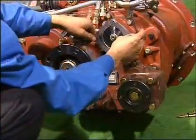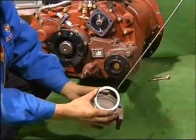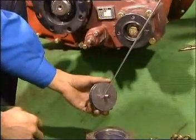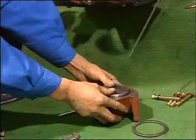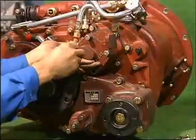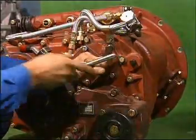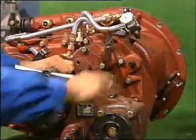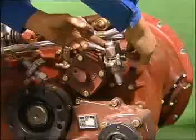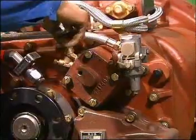Set the gasket of the shifting cylinder cover without glue. Check the cylinder middle assembly, position restricting ring, middle piston, and O-ring. Assemble the middle position cylinder: first install the O-ring in the piston, add lubricating grease and push it into the cylinder body. Second, set the position restricting ring and combine it with the shifting cylinder. Finally, fix the middle position cylinder with 4 bolts with the pressure adjusting installation part outwards. Set the 45-degree elbow on the cylinder of shifting position. Fix the pressure adjusting valve with 2 5x60 bolts. Install the high speed wind pipe on the cylinder.